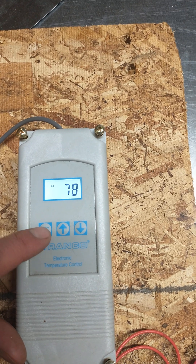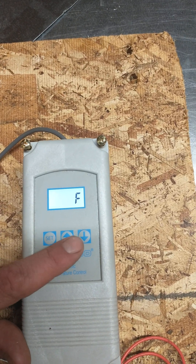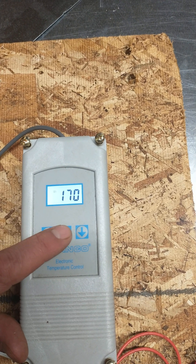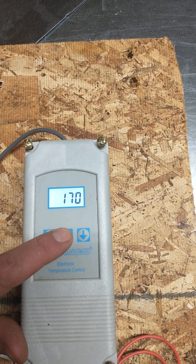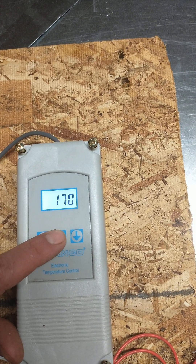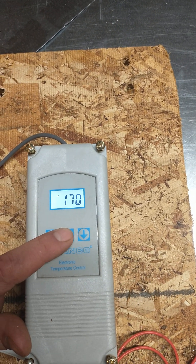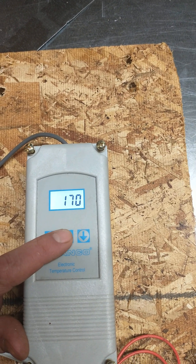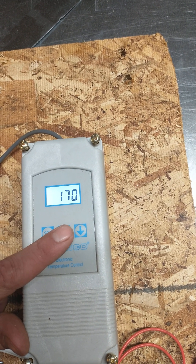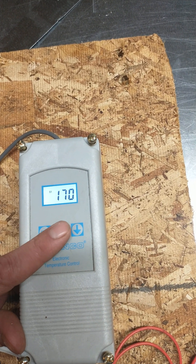To set the settings, press set one time — there's a Fahrenheit/Celsius option; toggle between them with the up or down arrow. I'll leave that on F. Second set is the temperature the stove runs up to and shuts off. Typically we run that at 170 to 180°F. Really cold weather we'll run it hotter; summertime we'd back off to 170. If the stove comes up to temp and shuts off and there's any air leakage around the door gaskets, it's going to creep a little over to 175 or 180. You don't want it going up to 190 — 180 is about the hottest you want to run on an open system like these stoves.